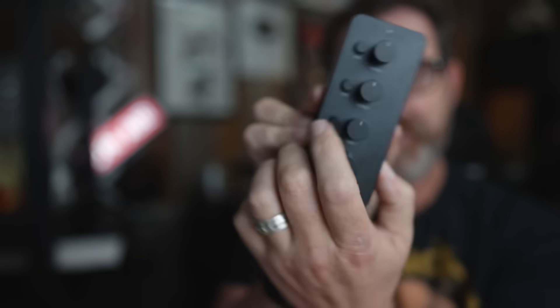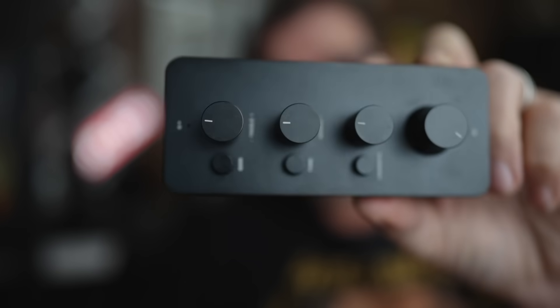With the SK-01, not only are you adding tone controls including mid-range controls, but my favorite feature is the loudness button. What a loudness button really does is boost the bass and boost the highs when you're at lower volumes, so that smaller speaker and smaller amp now seems like it has a little bit more horsepower under the hood. This product can be added on to an existing very affordable system — the V3, the Aiyima A07, a pair of the MICA RB42s, the Neumi BS5s — any affordable smaller speaker is going to benefit from the SK-01 because it gives you some controls.